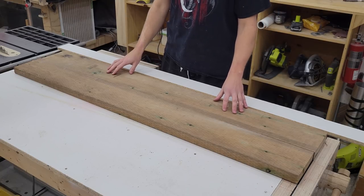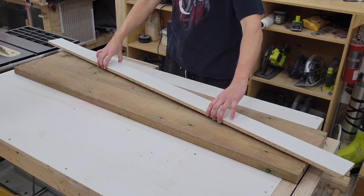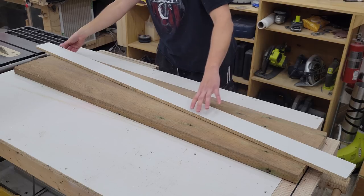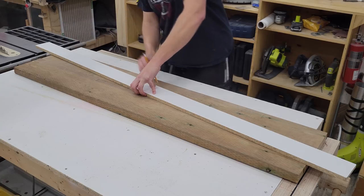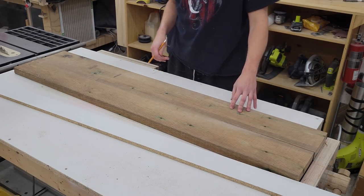So next we gotta cut up these two boards into 4 huge triangles. So I've got my straight edge here, which is just a straight piece of melamine. I'm going from this corner to this opposite kitty corner, as it's called. And I'm just gonna simply mark my line all the way down. So over at the bandsaw, we'll cut both of these out.